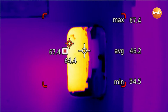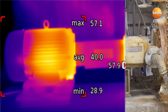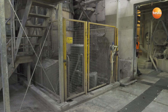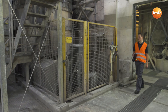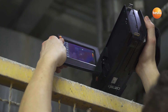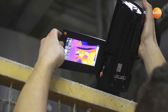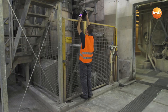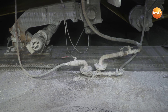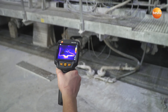In addition to shafts and bearings, motors are also relevant for smooth production. The danger areas of plants are often blocked by a protective grill. In contrast to imagers with a pistol design, the ergonomically constructed thermal imager Testo 885, with its rotating display and handle, allows you to measure conveniently behind the grill. Here, just a quick glance to check whether the pipe is tight.